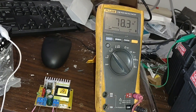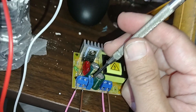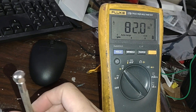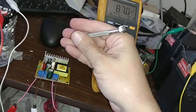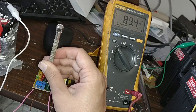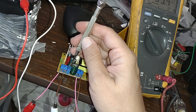We're getting about 78 volts out and there is a little tiny potentiometer here. I have a screwdriver to twiddle with it to see if we can change the voltage. It looks like it's going up — 85, 86, 87. I needed to charge some capacitors up to over 300 volts, and this power supply was claimed to be able to do that.